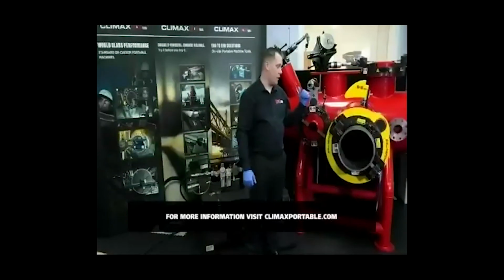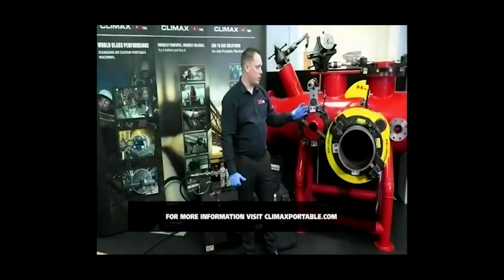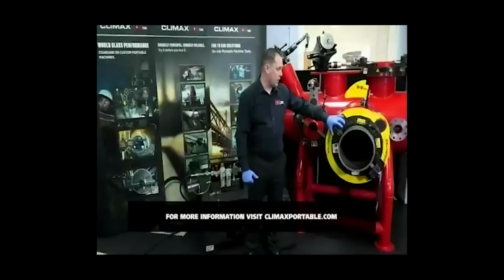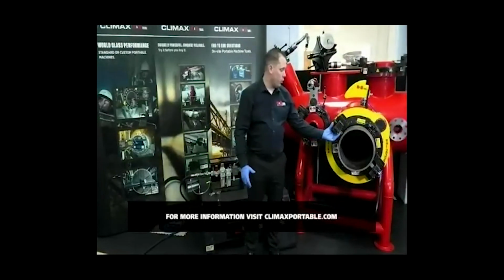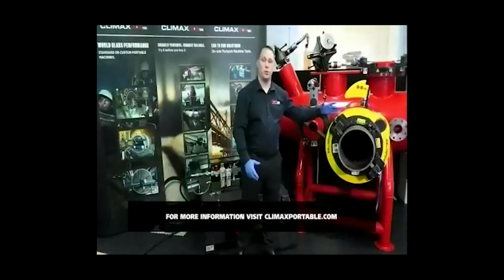If you were to use number 7s again with the shark fin, the tool slides themselves would be the biggest radial clearance obstruction. If you were to have a really tight tolerance job where there was an obstruction really close to the pipe, you can use smaller tool slides. So the H&S clamshell has lots of different accessories. So you can have smaller tool slides which sit inside the body of the machine. If that was the case, you wouldn't need the guard because there'd be no pinch points or obstructions.